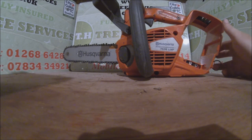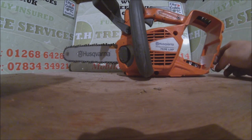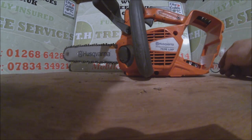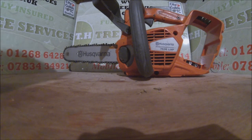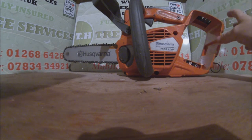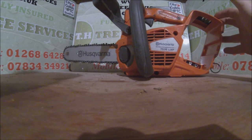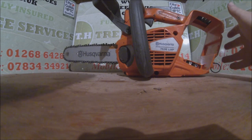You'd still want your petrol saw because it has its place. Neither petrol nor electric are unbeatable — they both have their pluses and their minuses. The minuses of this saw I've shown you. The big pluses: no vibrations or little vibration, little noise, no direct fumes. Those are three real big health and safety points.